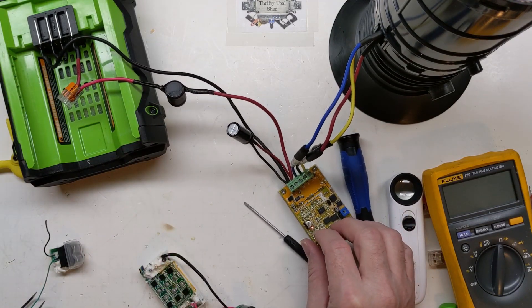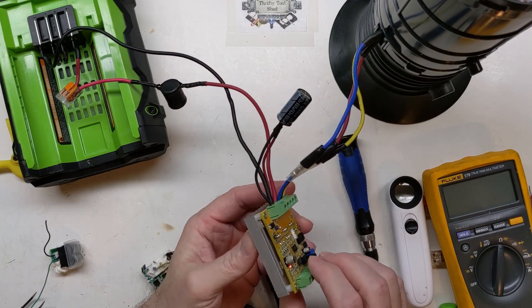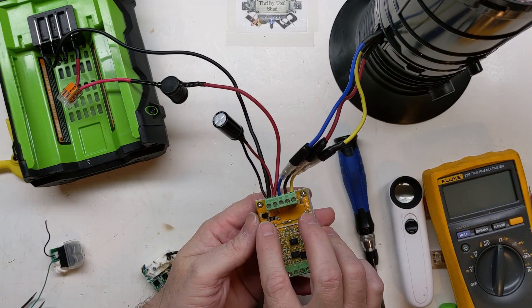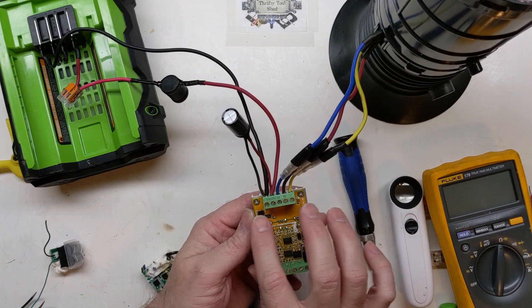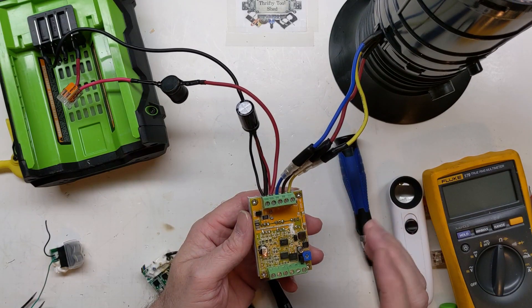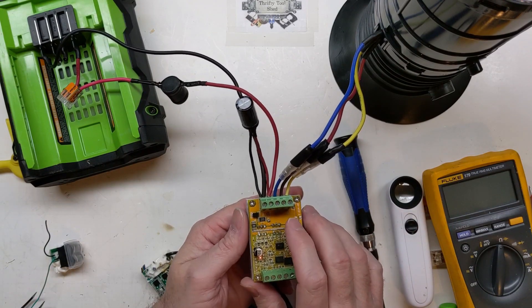I really enjoy these controllers — they're kind of a joy to work with, more like industrial-type terminals, easy to adapt. The only issue I've had, as mentioned in previous videos, is what I'm calling a flyback. It's just a diode across the bus and it is kind of small, so sometimes with too much current on a quick stop, I have had that diode taken out.